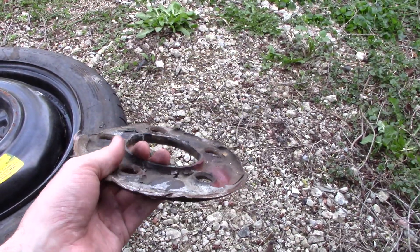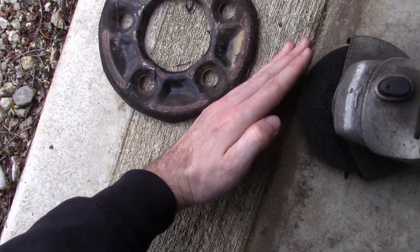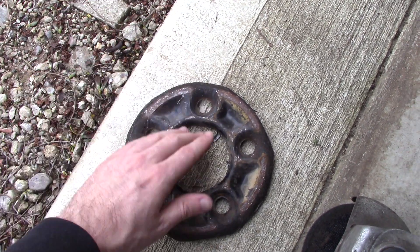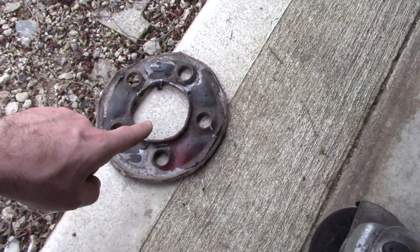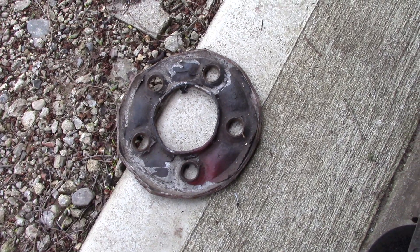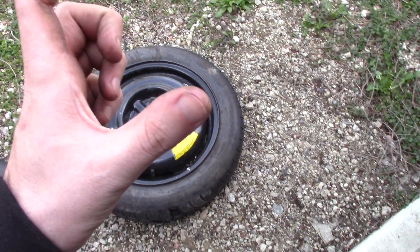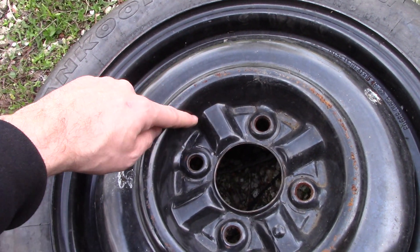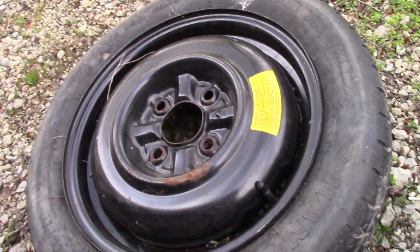It doesn't even have to be a perfect cut. I actually cut this one out — if you look at it, it's notched. I cut this out with a cutting wheel, almost like an octagon or a stop sign. Since I couldn't cut a circle with this cutting wheel, I would cut straight cuts, do them all the way around in a circular motion so my lines overlapped each other and eventually I cut out a circular shape. The other way I've been doing them, besides using a cutting wheel — because it eats through a lot of cutting wheels and takes a while — another method if you don't have high quality tools and torches: you can take your welder, crank it up really hot, put a stick on your welding rod if you have a stick welder, and you can actually weld, aka cut, with the welding stick and slice through this metal on the inner ring and cut this pattern out with your welder. I'm going to do that on this one right here — cut these centerpieces out with my stick welder.